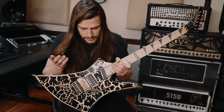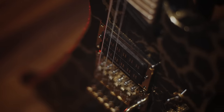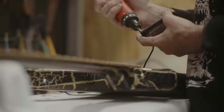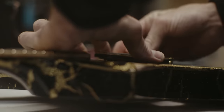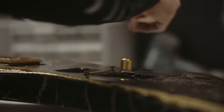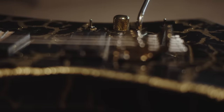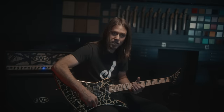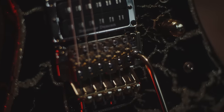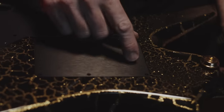Getting into the electronics, this is a sustainer from the PC1 models — basically a battery-powered active sustainer that makes the strings ring out indefinitely, either with the tone of the fret you're playing or a harmonic. In order to make this all work I had to hardwire the intensity so it's on full blast all the time. He really wanted to be able to use the neck pickup for studio stuff, so we did a push-pull pot. When it's down it's just a single hum, which is used 99% of the time, but pull it up and the neck pickup is activated.